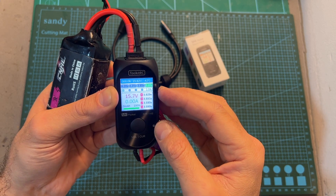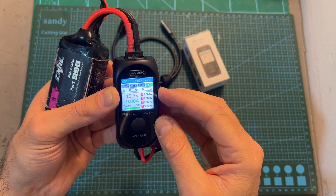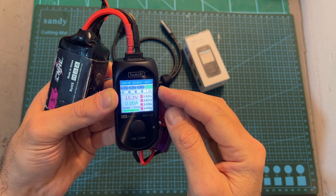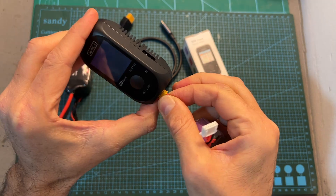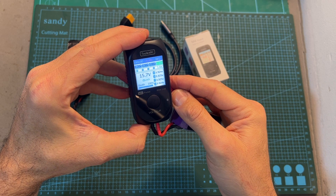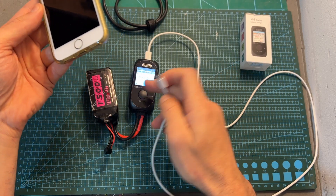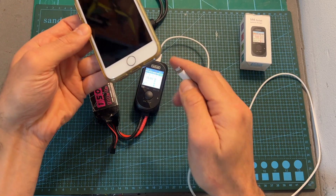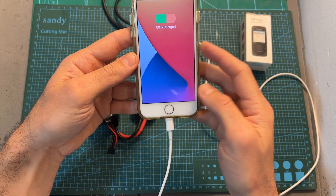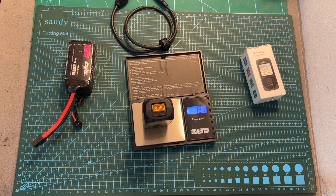You should note that while it's possible to discharge your batteries using the M4 Pocket, the discharging procedure is going to be extremely slow. The maximum output current is 5 amperes and the maximum balance current is 0.4 amperes. It can also be used to test your batteries, as the M4 Pocket powers up even when only the output ports are connected. When connected, you can use the USB Type-C port to charge your mobile devices at a maximum output current of 1 ampere. It weighs 73.1 grams.